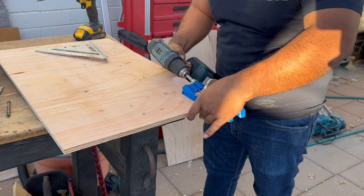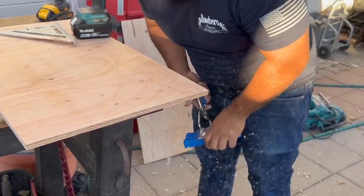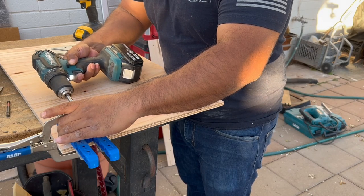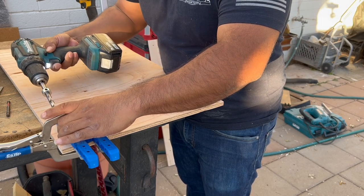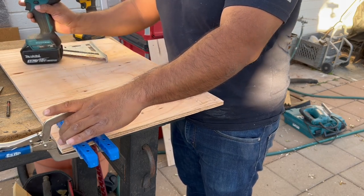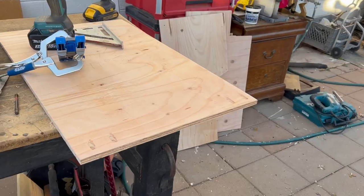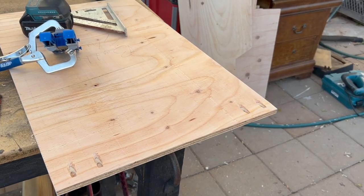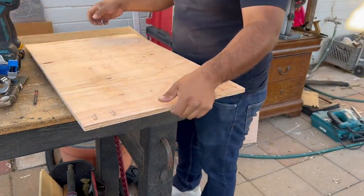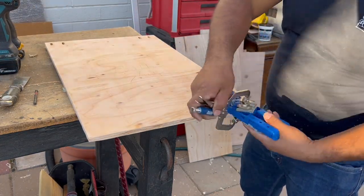This particular jig was about $30 at Home Depot. The advice I can give you: make sure the material you're using is half inch, three quarter, or inch and a half. Clamp it with enough force that the jig doesn't move when you're drilling. Drill softly, pulling in and out so you don't move the jig. On later projects I ended up using the vice grip mechanism that comes with the kit, plus an extra clamp further in toward where the drill enters.